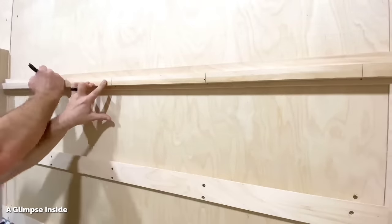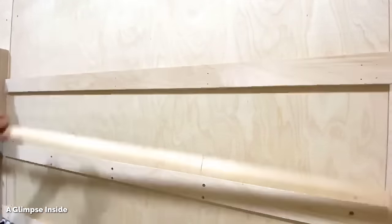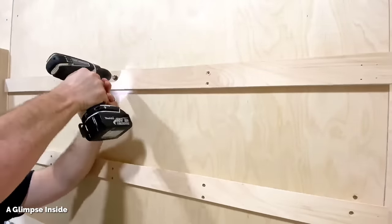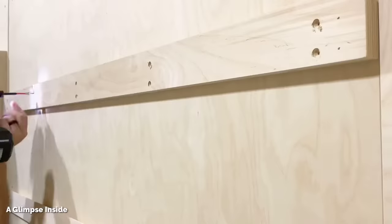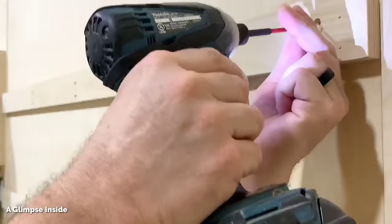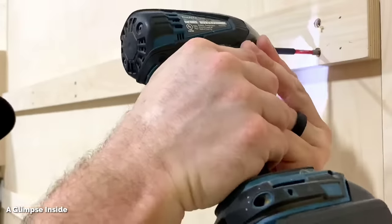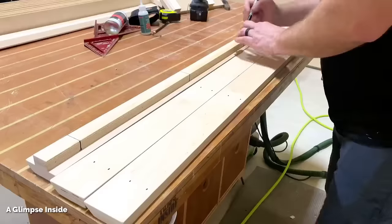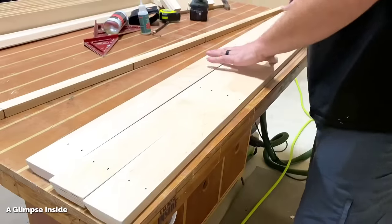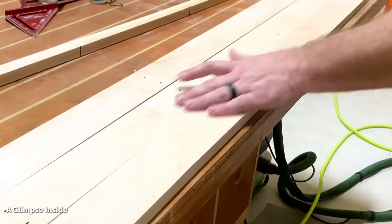Another quick tip is to make a story stick of where you want to put your screws — if you want the aesthetics to be lined up. I didn't do that in the first part of the shop and I wish I had. As I'm doing this process I'm learning that making things just a little bit more aesthetically pleasing is kind of nice, and this story stick allows me to do that. If you're smart, you'll do this on the workbench instead of up on the wall and then mark your marks. But as you can see, I changed my method and this works really well.